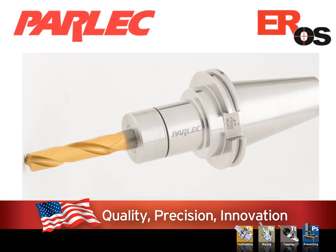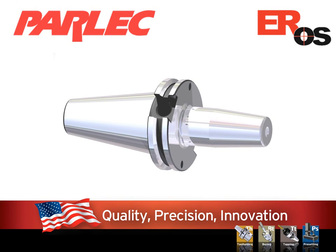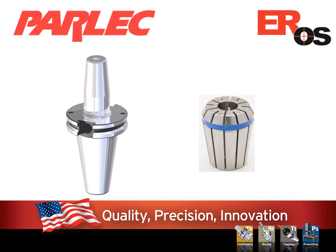If you still have reservations about the value of Eros, let's compare it to other high velocity, high precision holding systems. Let's start by taking a closer look at how it compares to heat shrink. The shrink philosophy is quite simple, but the practice isn't always. Heat up the tool and the thermal expansion of the bore creates clearance to install a tool; as it cools, it grips the tool. Not a lot of time available to set cutter lengths or make other adjustments — make sure you wear your gloves. Over time, when the bore of your shrink holder wears, you will need to replace it — it becomes quality scrap metal. The 2 micron collet of the Eros system can be replaced at a fraction of that expense. And as an added benefit, the identification band can be removed and you will have a precision collet for your standard collet system.